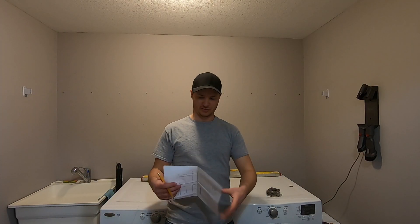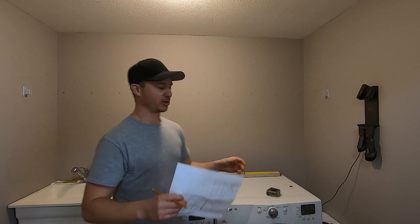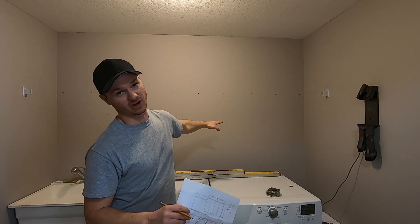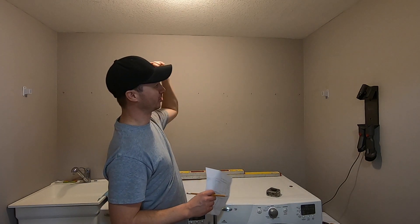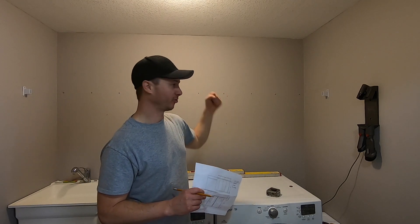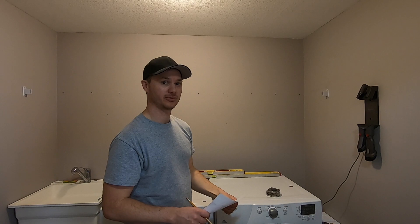The first thing you're going to do is review your drawings and check the layout. Mine are going to go an inch off of this wall and then about 55 inches off the floor. These 34-inch cabinets are going to give you a good reveal at the top and we're going to have a gap on the side. I'm going to be putting doors on these, so we need to keep those gaps to give clearance for the doors.